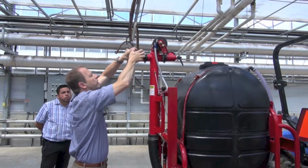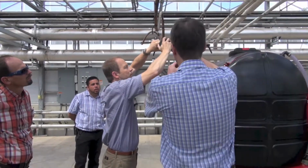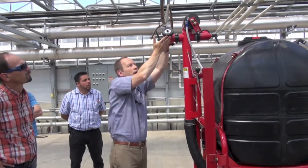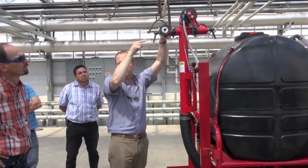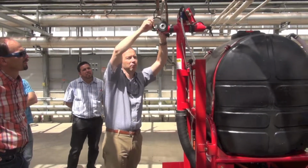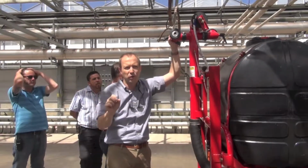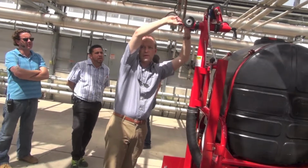One thing we want to do is make sure that, because that tube is in there, see how we're adjusting. I can adjust this nozzle height position. What I always want to do is make sure anybody using this thing or adjusting it goes over the top. Okay? Don't go 360, because then we're going to start twisting this tube inside. It can take this, no problem. But because of the bar in the middle and everything else that's adjusting your angle, we can twist that in there. All of a sudden you won't get any flow out of there. It'll clog up. Even if it twists and kinks a little bit, that becomes a point for stuff to deposit. We just want to make sure that you're always going over the top with the nozzle angle.